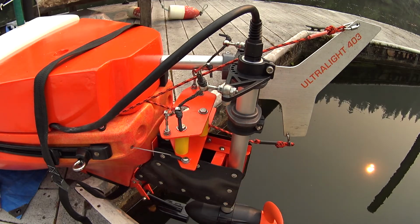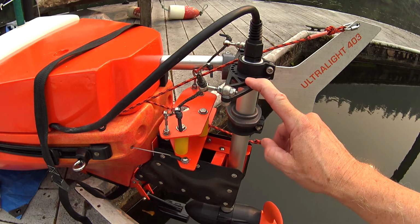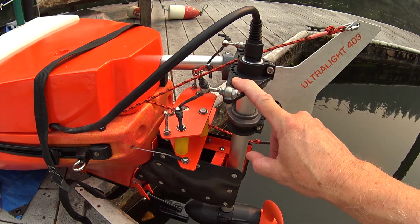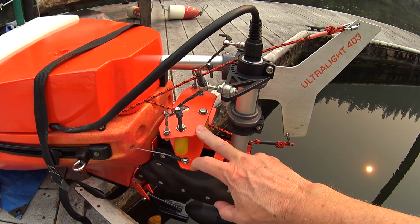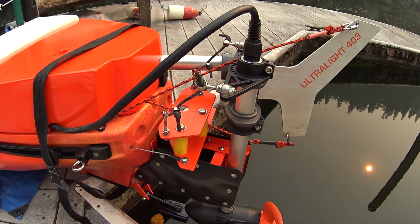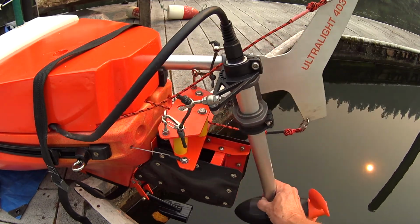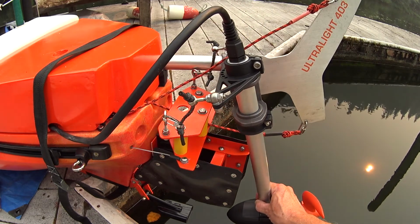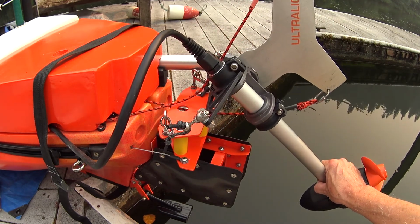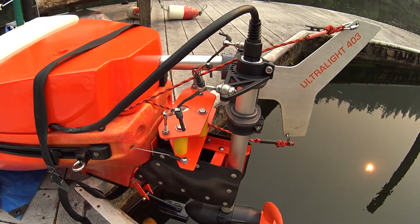And you notice on this boat, where the cable comes out and where the height of the triangle bracket is, it's a considerable distance, which is why I ended up with this two-tier plate with an additional line to bridge the gap. One reason I went with a line here is so that when it does rotate, there's nothing binding that rotation. I thought about using a steel cable initially, but it would tend to want to kink or bind when the rotation occurred.